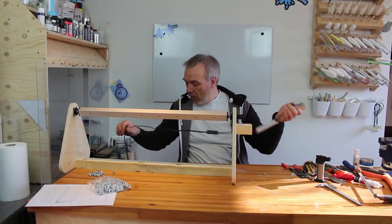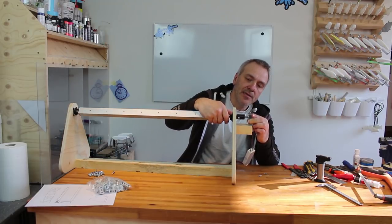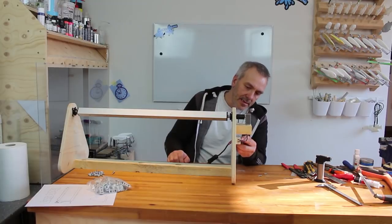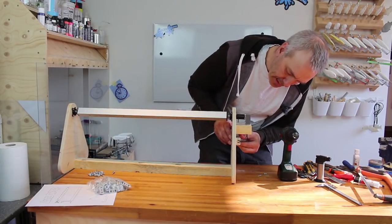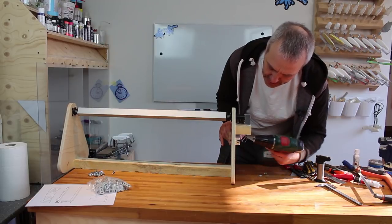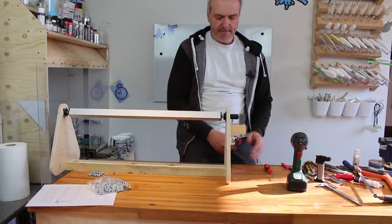Okay, so now this whole system is put together, and I'll just start attaching it to the dryer here. So first of all, I need to find the spot where the motor can go in, like that. So now it's all the way in there. Then I need to put this in place, the power supply here, and I'll just put a few screws here so the power supply will stay in place, and I'll just hold it in place while I drill some holes here without damaging the wires, of course. Just need to make a mark actually.